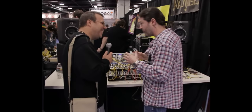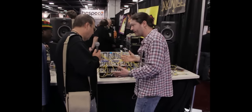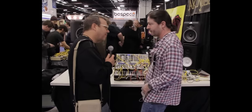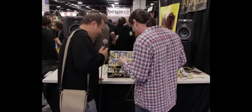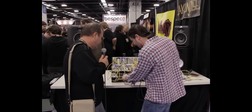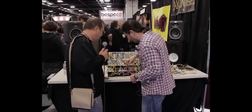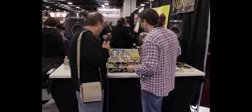Today people are more sophisticated — they can hack stuff and deal with stuff. You get the concept: I need to calibrate my instrument. No problem. You take the module, sit with it for about 15 minutes, and you've got it calibrated. What we hear right now is we took the square wave out into this breakout module, which converts the signals into regular jacks that can communicate with other modules. We take four of the oscillators and mix them in the mixer here and into the filter — and that's what it is. And you've got your matrix sequencer programmer over here playing the sequence.